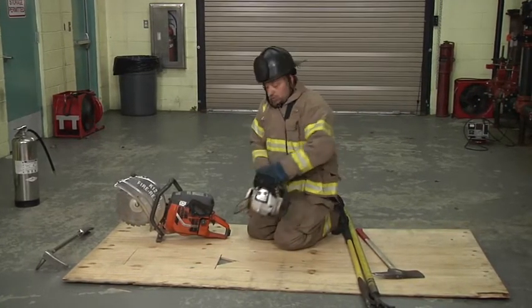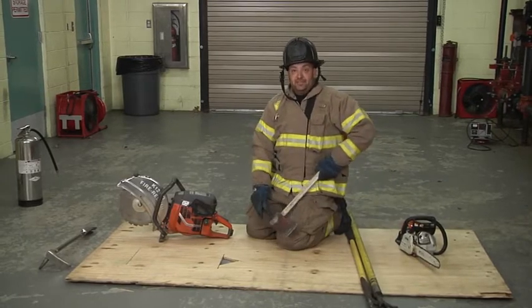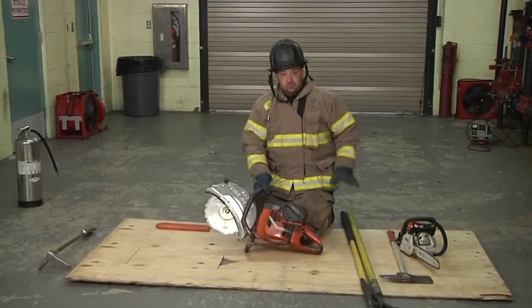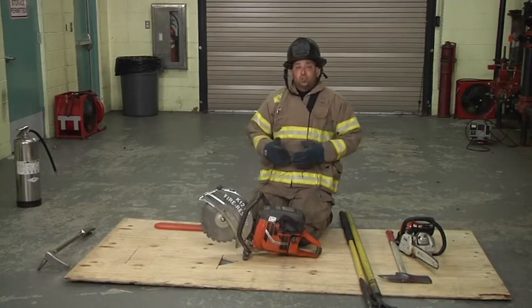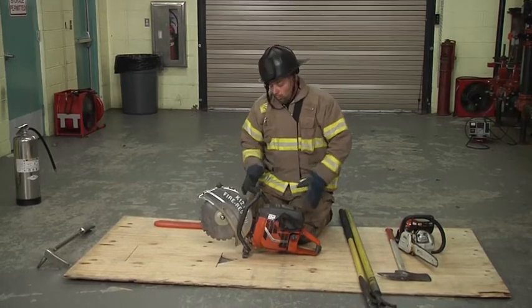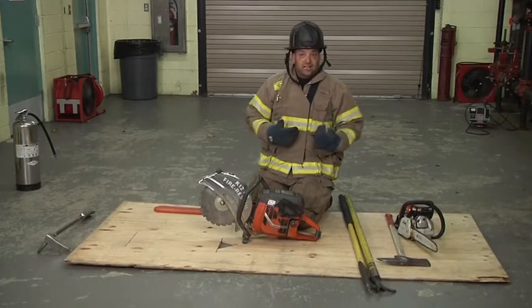It's made to fail. So as you go and torque this and snap your chain, you better make sure you have some tools with you because conventional methods are going to have to come into play. With our rotary saw, getting back to this — as it's running into the roof, if an individual is not properly trained and they start to bind it down, what will happen is you'll hear the belt start to squeal and smoke, and that will be your sign to stop cutting.